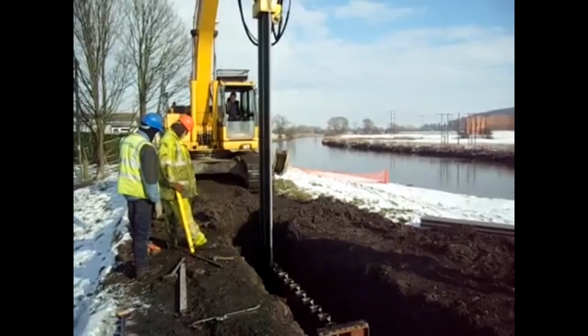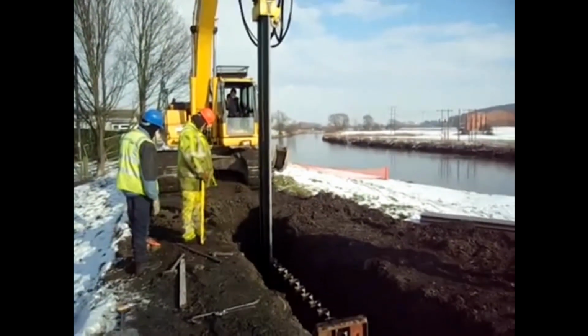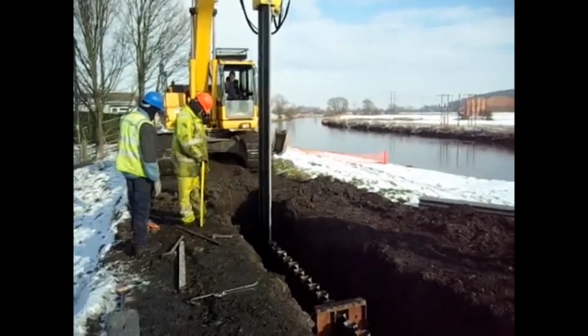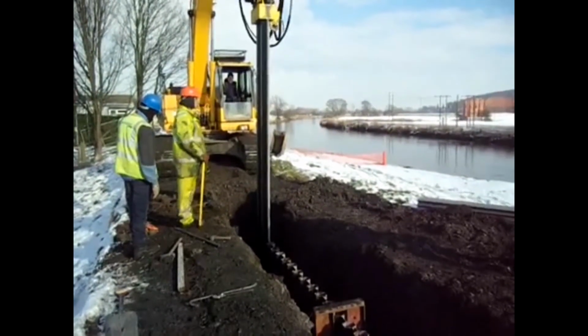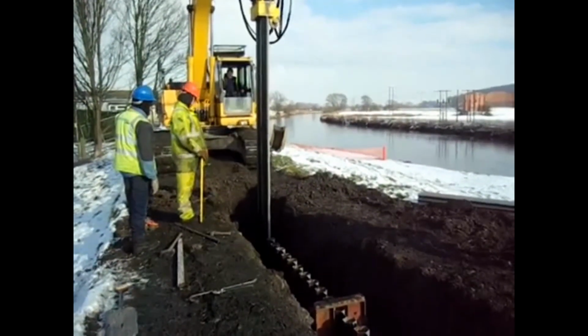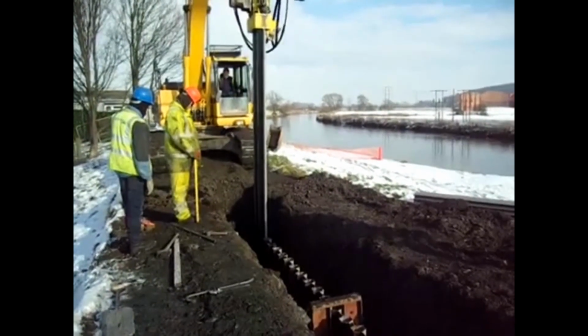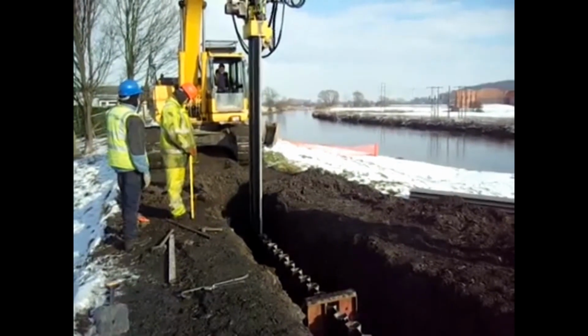What you'll see from the video, in this particular video setup, in this scene, and also in the next video, is that as we're driving through the ground, there's a lot of resistance that we're having to overcome. So the internal mandrel design, much lighter, and so we can get away with a much smaller piling vibrator, so again the size comes down. Or for a given size of piling vibrator, it is much more effective.